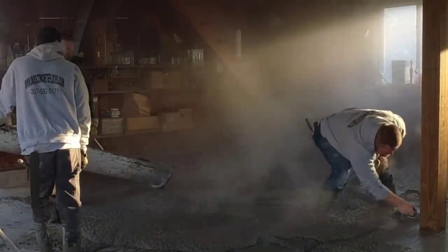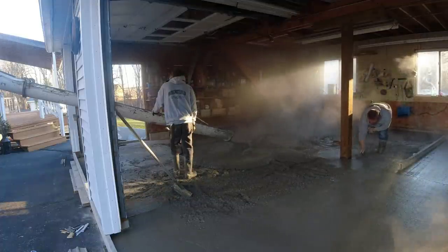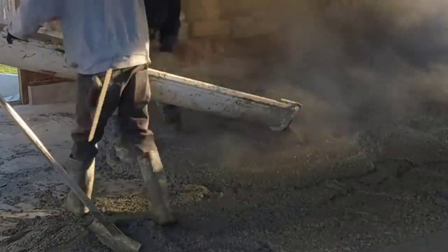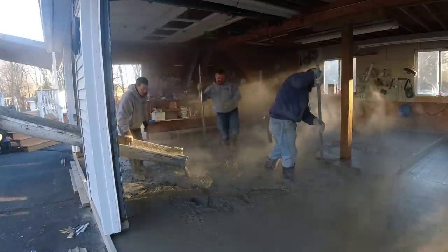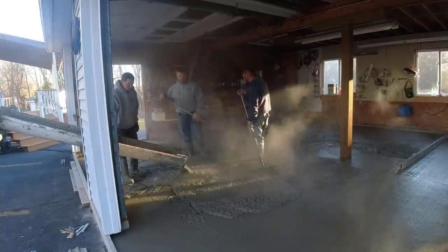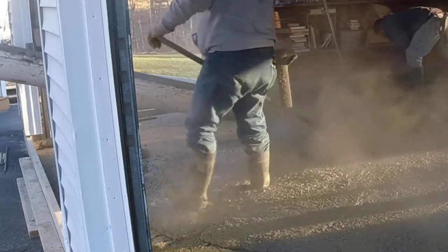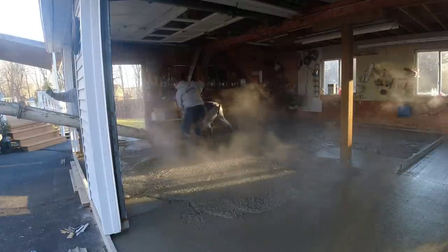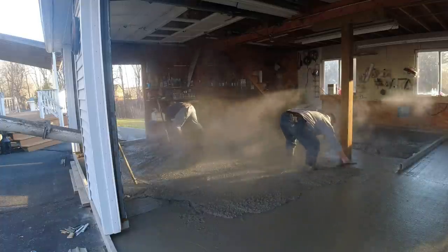We're magging to our lines around that post — it's a treated post, so the concrete won't bother it. We have a chalk line snapped on the blocks, so we're magging our grades to that chalk line. At times it's pretty hard to see with all that hot concrete steaming right there. We're using a water reducer too, which helps limit the amount of water needed to get a really good flowable slump. We use very little water in this mix and can get it to flow really easily — that helps make the pour go quicker. We've also got hot water and some accelerator in the concrete to help it set up a little quicker today.